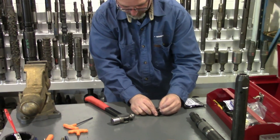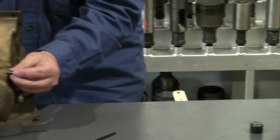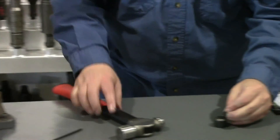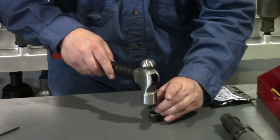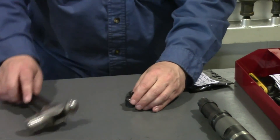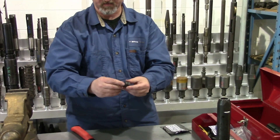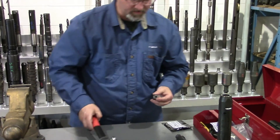Line it up and make sure it's got friction. When you install it, it stays firmly in place. You want it to stay firmly in place and not spin on your punch piston — nice and solid. You don't want to torque on it because it's just a small pin, but you want to make sure it's not spinning.